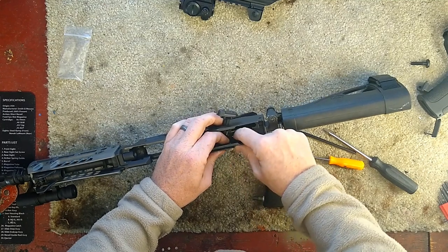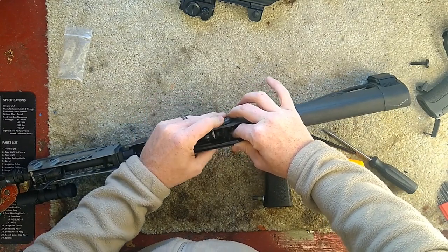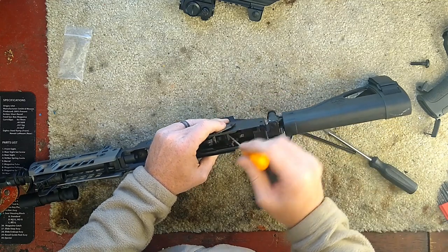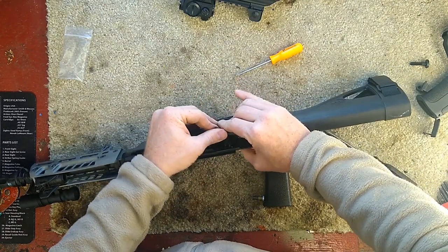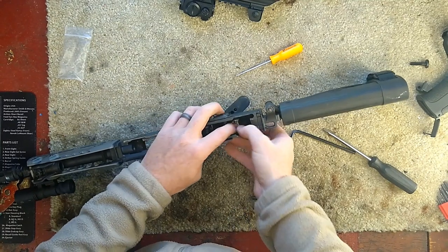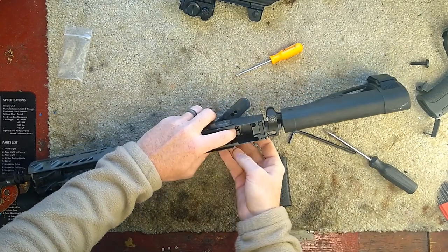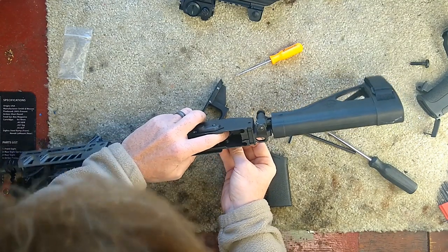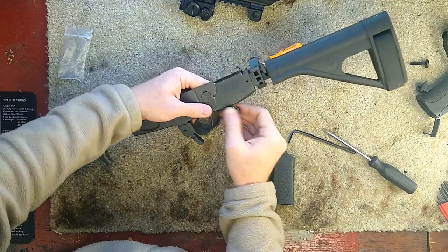This really isn't that hard when you're not worried about leaning in front of a camera. I got the left side safety on the part of the right side safety. We just want to line up that last pin with the outside hole of the receiver and it will snap in place. Rock it down so we don't lose it. Now we drop in the new pivoting point from K&S into the same spot as the old one, lining up that pin with the hole in the left side safety arm — and we're locked in place.